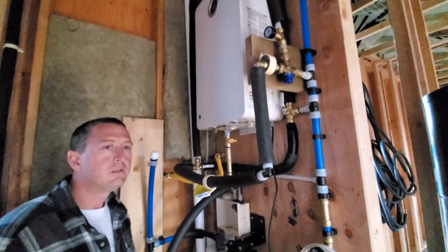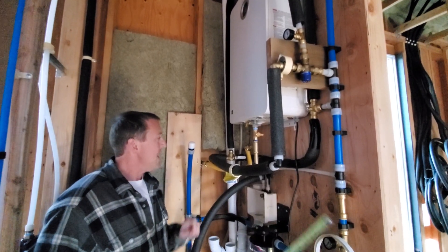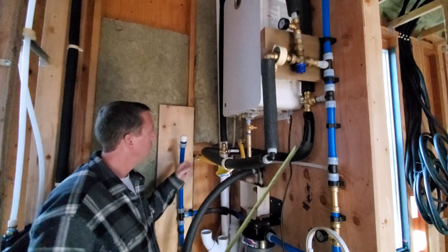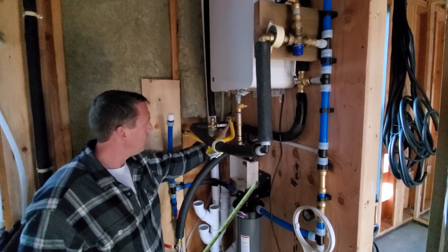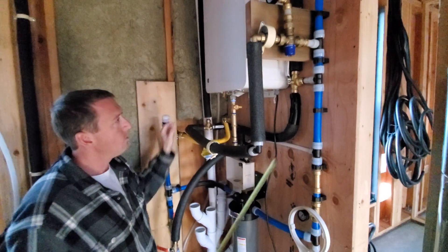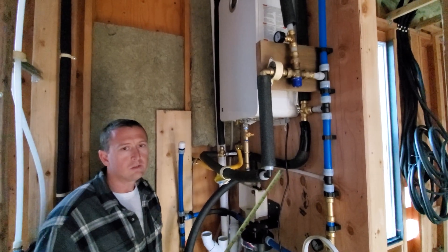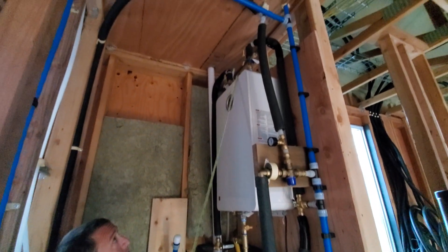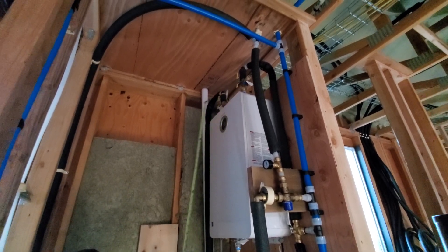What if the tank is working but the tankless isn't? In that case, we leave this valve in its current position. Hot water comes through here, goes around the other route to bypass the tankless, and follows the same distribution path. These three-way valves allow the system to service all possible scenarios. Up at the top there are also isolation valves — close those two, and the whole tankless unit is removable.